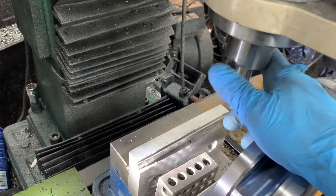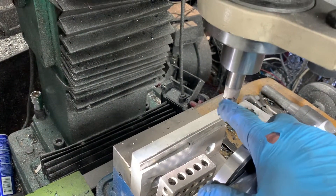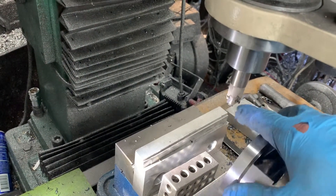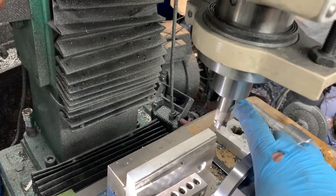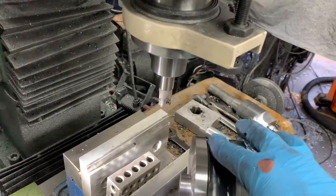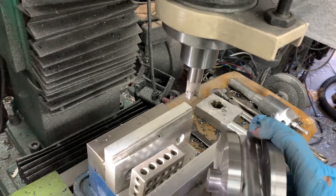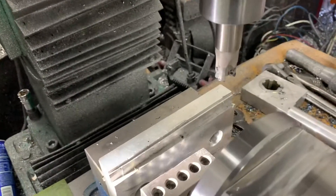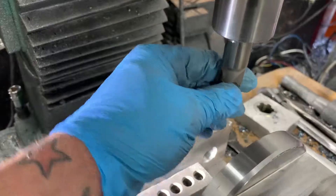I do really like these inserts — you just don't want to go past the shoulder. I also have a high shoulder helix cutter with six different inserts in it, which probably would have been a more appropriate tool for this since I'm going a bit deeper. We'll give that one a try in part two, finishing up with the Sandvik R390 — the eBay special.